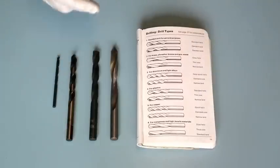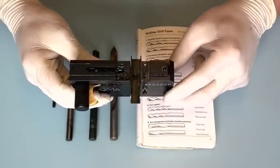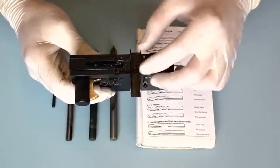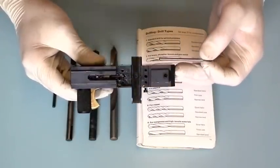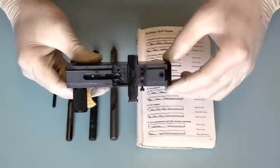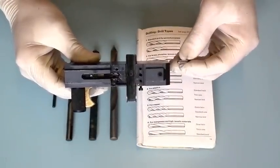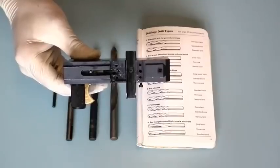Now, I'm sure most of you were probably quite worried about drilling the hole in your air reservoir for the breathe port. And so, having tackled that, the thought of drilling the transfer port out probably isn't a great worry because there's already a pre-existing hole drilled for you to follow. You haven't got to line up, dot punch, etc. That's already been done because there's already a transfer port hole there and you're simply enlarging it.